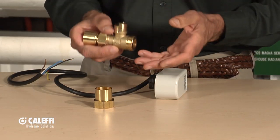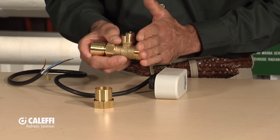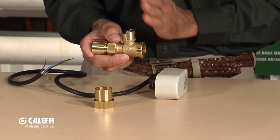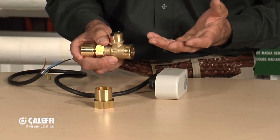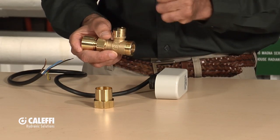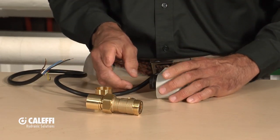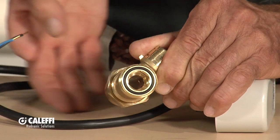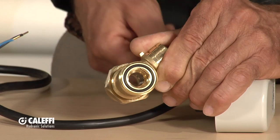It's a unique valve with high shutoff pressure — 150 PSI shutoff. That's the delta P, or differential pressure that it'll shut off against, which is typically about twice what you'd get with a flapper-type spring return zone valve, because it is a powered valve both ways. And if you can see down the bore, you'll notice it's a full port ball valve, which is how we can get such high flow rates through it.